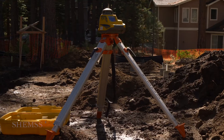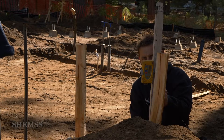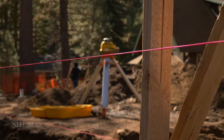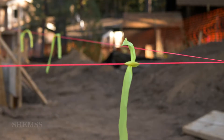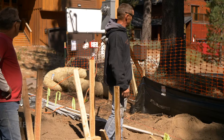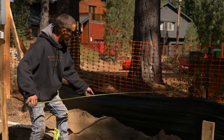First we use the laser to find the highest point for our house elevation reference. We're placing this house 15 feet from the property line. The minimum setback requirements are only 5 feet from the sides of the house and 20 feet from the front of the house. Our property line is way over there — it's at 15 feet from the house.